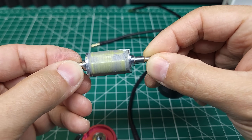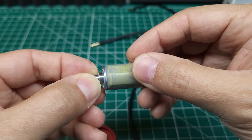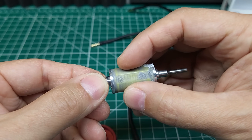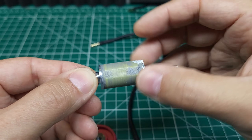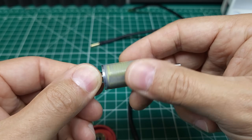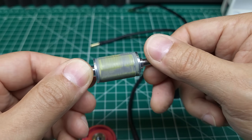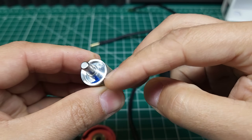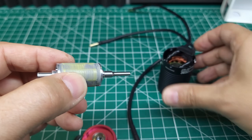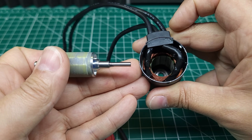As we can see, we've got a pretty standard-looking rotor. These are permanent magnet motors with neodymium magnets inside, and Kevlar wrapping around them — that wrapping is what stops the magnets from flying off at high speeds. This is also something that can get damaged by debris; grit can wear away the Kevlar and eventually those magnets come flying off. There's a little balancing weight on the front and rear, so this should be a smooth motor. Inside, it's a fairly basic setup — again with a shielded bearing in the front.